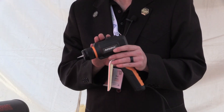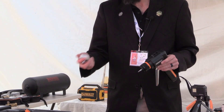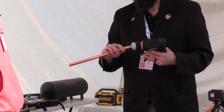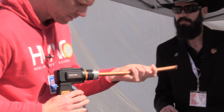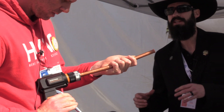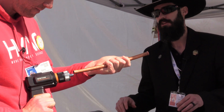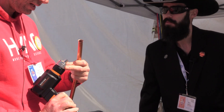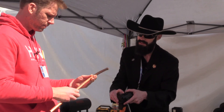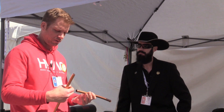It's kind of been a thing everybody has, but this is a redesign. These are the same heads that work with our automatic. Nice thing about this one is you don't have to worry about splitting your copper ever, because there's an actual stopper inside. Just like your normal one, just keep cranking away. You'll start feeling it get harder a little bit. Once it gets hard, you're going to notice it release all by itself - you don't have to stop and twist it, nothing. There's no readjusting. Once it hits that limit, it automatically resets. If there's any reason you need it to stop, there's a manual release on top, but you won't need it. The purpose of that design is so you don't actually overstretch it even one click too much and create cracks in the copper.